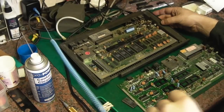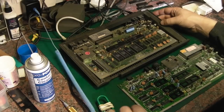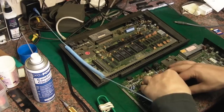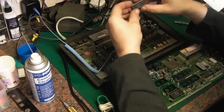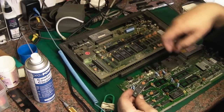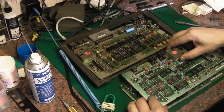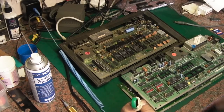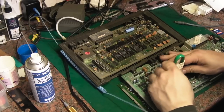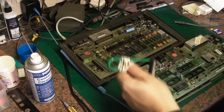So we know that the 318006 on this board's alright. Let's stick you back in there. But when we tried the 318004 off this board on the Plus4, it wouldn't boot. So let's try that IC off the other spare boards we've got, and we'll make sure we've got a good one, and we'll try that on this board with the ICs in it again, and see whether that'll get it to boot. So out you come. That's tight, that one. Dear me, he was tight.